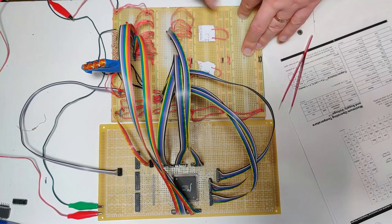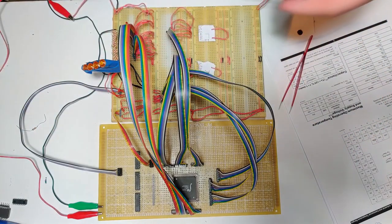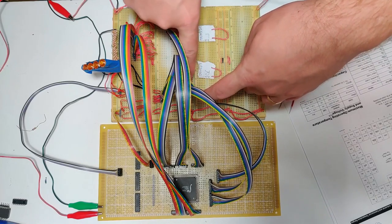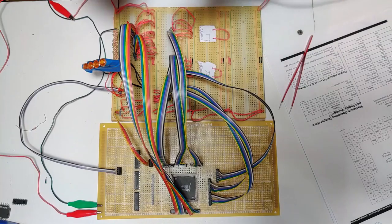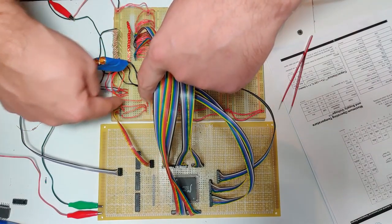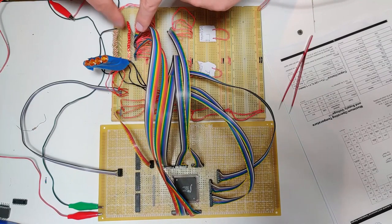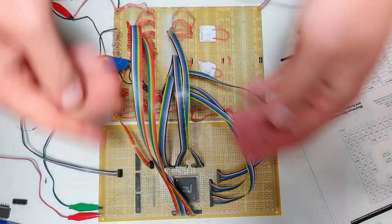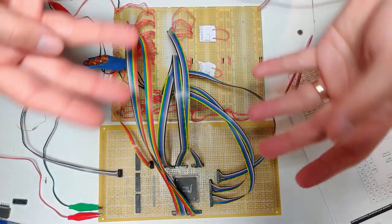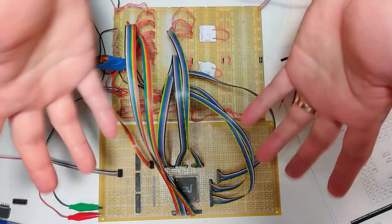Then output enable, which is tied low. It's active low, so that means we're always enabling the output on the video side, so that we'll always reflect whatever is at this address, and we'll just keep reading it constantly. Then we've got the input from the CPU, all the same signals, but right now I've got them tied slightly differently. The idea here is we're going to turn this on. This will always display whatever position in the 16 bits is selected by these little jumper wires. This is the input side, so we will use these 16 wires to control, and hopefully these LEDs will be visible. We'll be writing those into memory, and as soon as we write, that should update the output, because we're looking at the same address but on two different sides of the chip. That is the crux of having video and the CPU access the video card at the same time without huge bus conflicts, because they have completely separate buses via this chip.